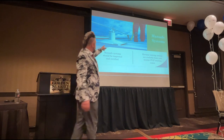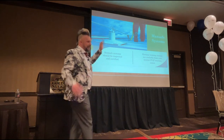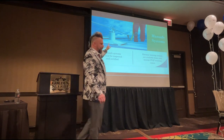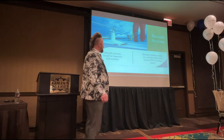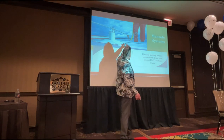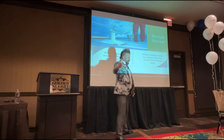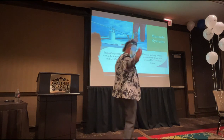No, they're permanent. So that's a fixed one that's bolted into the roof sheet and they need to be inspected every year in the UK. Don't know what your man-safe laws are over here, but these have to have annual inspections. I'm talking about the line or the cable. The line, so that's a carabiner that's attached onto a rail that runs along the line. That's detachable and he can hook it onto his own harness. So when he goes onto the roof, he clips himself on.